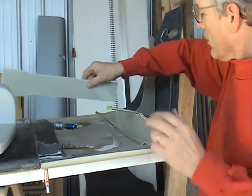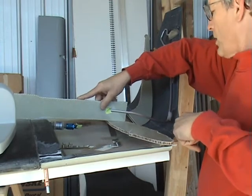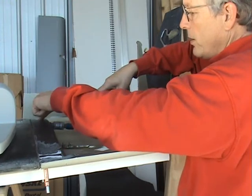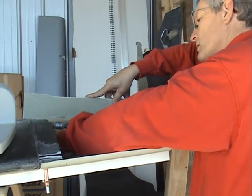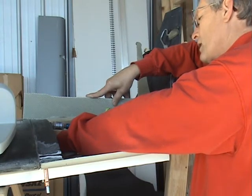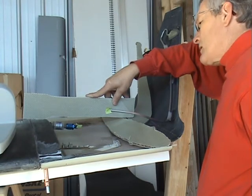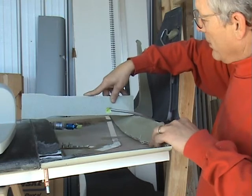And this piece here, which also intersects at this 10.5 inch setback point from here, has these bumps in it, so it fits in the winglet, although you can't really glue it to this part, so it's going to have to be cut off somewhere here. And lately Lancair has been putting the fuel probe in this end of the wing, so this piece would run almost into the fuel probe, and you have to think about if it's a problem to have the electrical lines on which side. Do you need to have holes that come through? And so you've got to think about all of that.